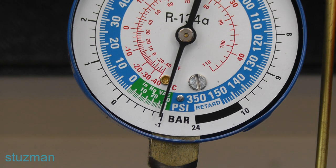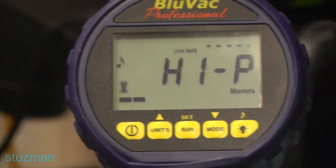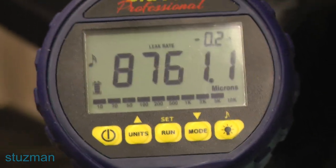It's been 1 minute 49 seconds, and it looks like maybe 28 or 29 inches of vacuum — hard to read, the resolution on the gauge isn't that great. So what do you suppose our micron gauge is reading over there? According to this compound gauge right now, it shows we should be good to go. But taking a look at our micron gauge — we're still at high pressure. We haven't even gotten down to 25,000 microns before this gauge will read. Let's continue on with the vacuuming.